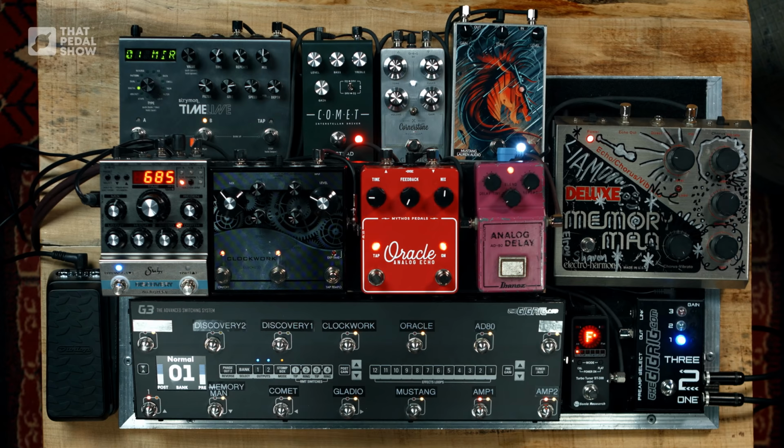Yeah. So it is an absolute classic. And to me, still the one that everything is measured by. There's been loads of different versions, but this is still my favourite, the 24-volt version. It just has a sound. So it uses the famous old MN chips, the MN3005s. Old Panasonic chips. Has maximum of, what, 300 and some milliseconds delay? Well, this one's got a maximum of 600 milliseconds. But I've never heard one that goes to anywhere near 600 milliseconds. But if it's set up properly, if I sent this to Howard Davis, he could set it up so it would get me like 550 milliseconds. But I've never heard one that's come out of the shop. It does 600. And then, of course, the modulation.